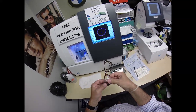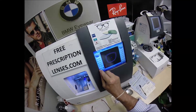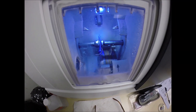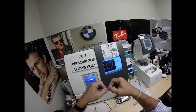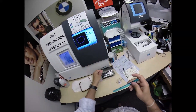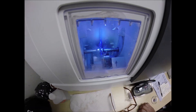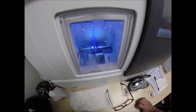Let's see if it fits first time around. I'm going to tuck it in at the outside corner — it ain't even close to fitting. I'm going to take it down two-tenths of a millimeter — point two-oh — and hit the retouch button. The door closes, the clamp shuts, and it's just going to go to the bevel wheel and take two-tenths of a millimeter off. To all my American friends who have no idea what a millimeter is, it is the distance between my thumbnails. Now, this is one of the few times I may use heat — I will do that on high-index lenses, but no need for polycarbonate.